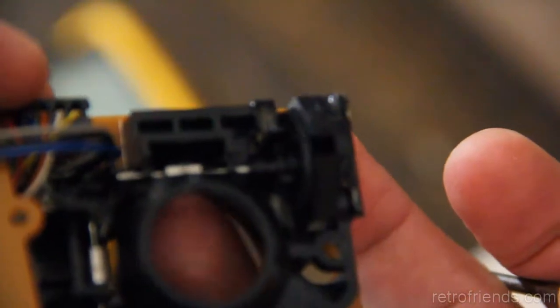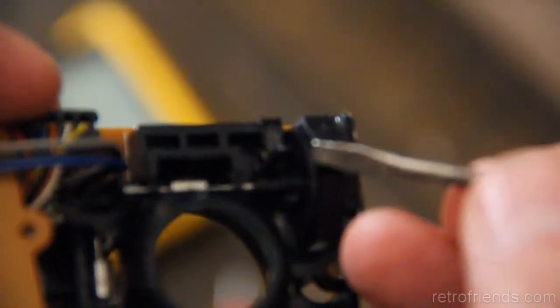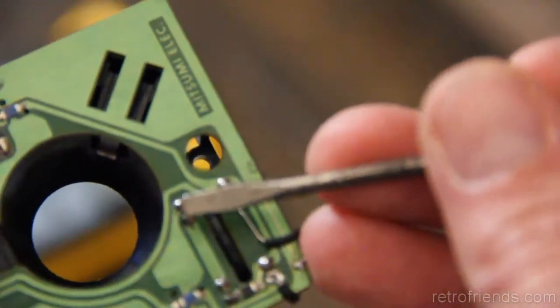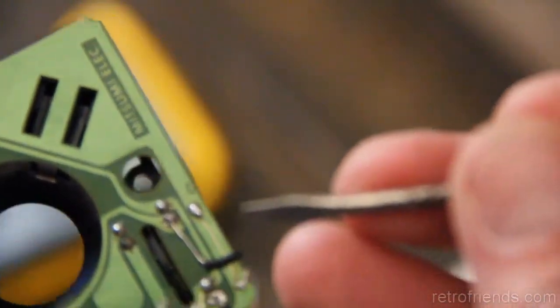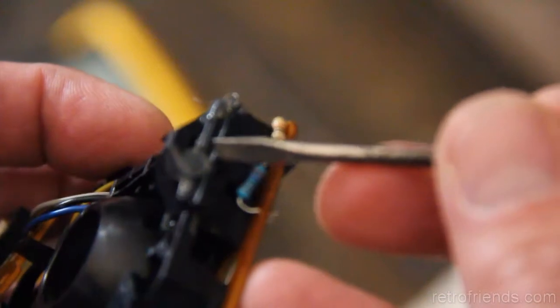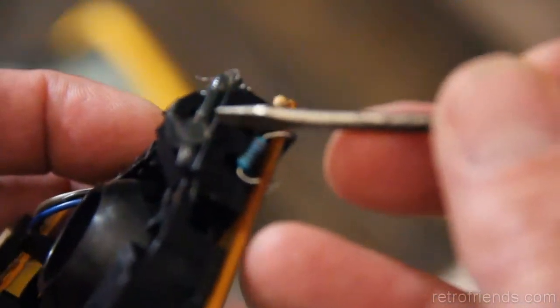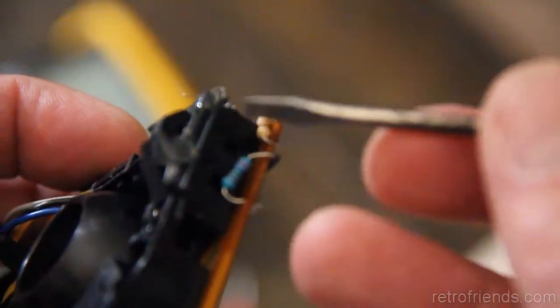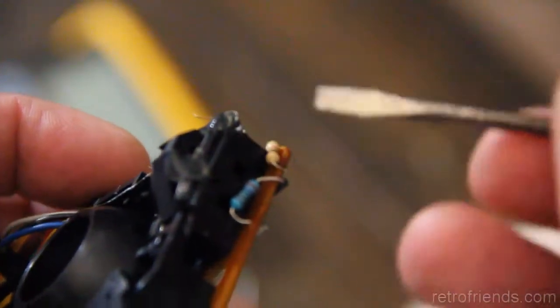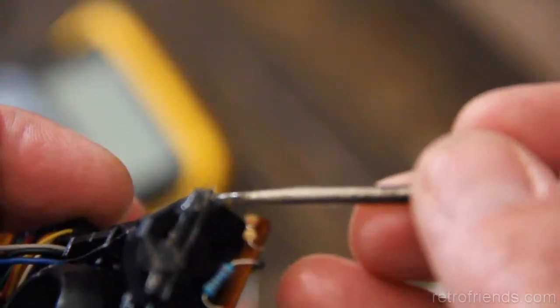As you move the mouse, it rotates this shaft, it turns this disc, and the disc has slots cut in around the edges, and it makes or breaks the signal between the LED and the photo sensor, photodiode. And you know, I busted this part. You can see my repair. I just got some pieces of plastic and sort of glued them together, and then took that little assembly that I'd made and hot melt glued it here in case somebody wants to pop it off. It'll pop off with just very little force and a knife.